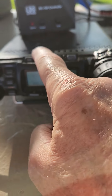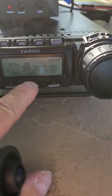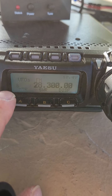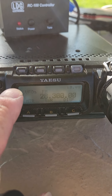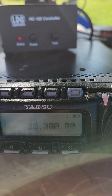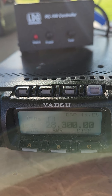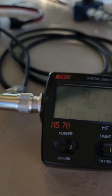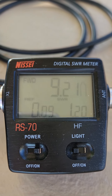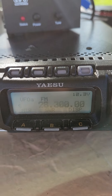Let's go up to 28.300, FM mode. We have our handy push-to-talk switch, and my meter is set up for measuring SWR — watch this bar go up and down as we tune up on 10 meters. You can see it hunting, going up and down, looking for a solution — and it found it! Out of 10 watts in, I've got 9.21 watts out with a 1.2 SWR and 0.09 watts of reflected power. Not too shabby!